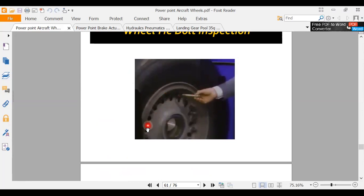So when I worked at the airline, the airplane would come into the gate, they'd shut down the engines, they'd dump all the cargo out of it, the crew would go away, we would check the engine oil, we'd do a walk around, look at the wings, we'd look at the wheels. Every time, I took my flashlight and shined it on each one of these bolts. And one night I had a DC-9 that was missing a tie bolt. And I said, hey boss, we got a tie bolt missing. And my crew chief said, hey, that was a really good find. I said, I look at them all the time. When I worked corporate, we had one break a tie bolt, and I always look at the tie bolts. That's one of the easiest things to inspect. And that's what was broke on my motor glider, was a tie bolt.